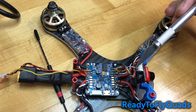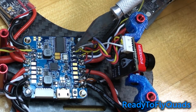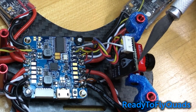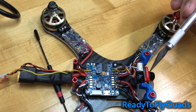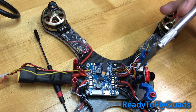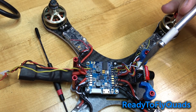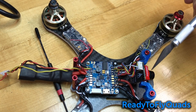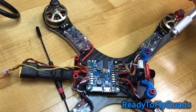I've run my OSD white cable here to the camera control, which lets me go in and modify the sensor settings for the camera. I also ran the blue cable — the voltage sensor — right down to the ESC power as well, and that's going to provide power to the camera if I want to use it for OSD.